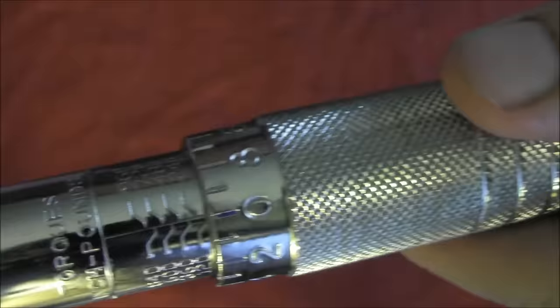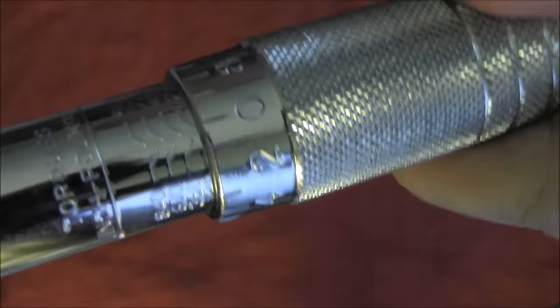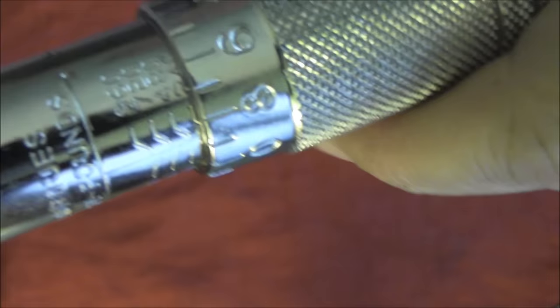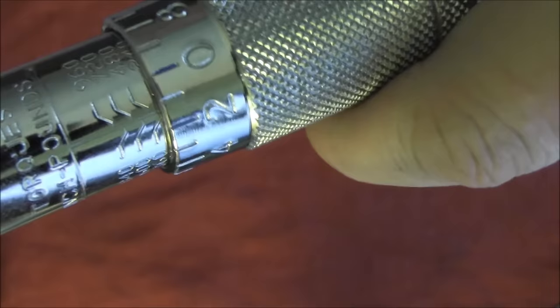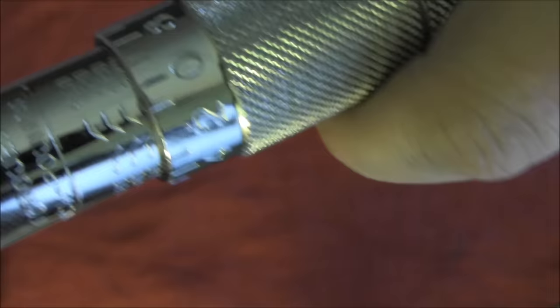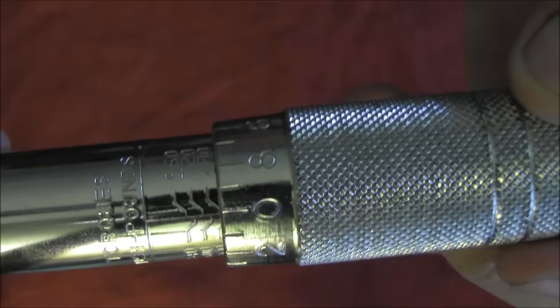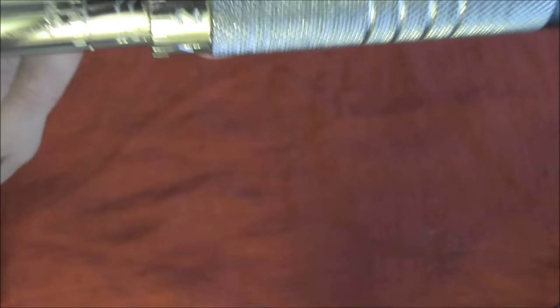It's going to be kind of hard for me to do this while you're watching, but I'll give it my best shot. As you can see, as I turn this, it slides up the bar. We want to take it to 480 because we're going to set this to 504. So here's my 480, right up there. I'm stopping and setting it to zero right at the 480. There it is. You can see the 480 slide mark, and that slide touches the vertical bar at zero. So now we're at 480 inch-pounds of torque — that's 40 foot-pounds.